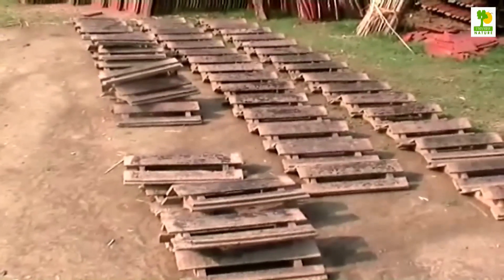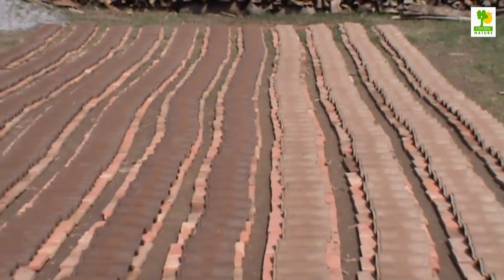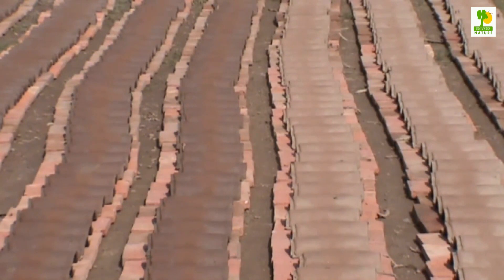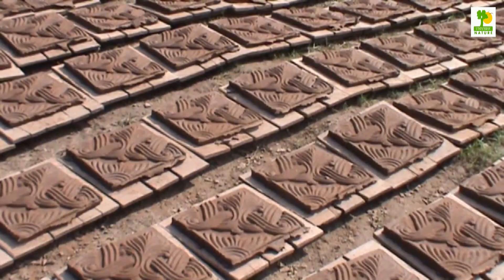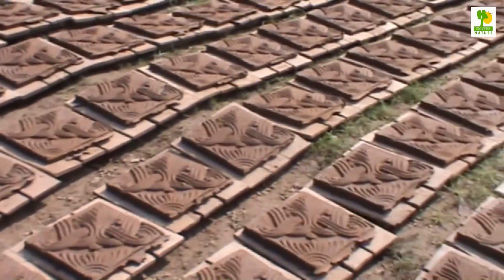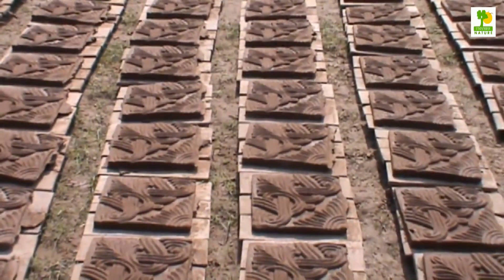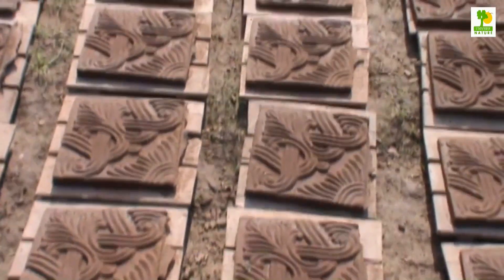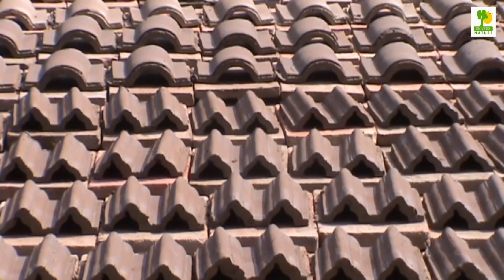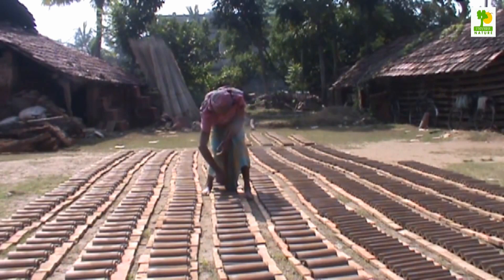Drying racks and pallets are one of the more expensive elements in a tile factory, so careful planning is called for. The racks are typically built up to fourteen feet high to conserve factory space, usually against outside walls for easy access and exposure to drying breezes. To stack tiles, boards are put across the aisle resting on the stringers of the racks. Since the racks will be holding hundreds of tiles and one or more people handing tiles up, they must be sturdy. Uprights are placed on approximately 1.5 meters center, built from 5 cm x 10 cm lumber. The stringers are notched and nailed into the uprights, made from 3 cm x 6 cm lumber. The aisles are around 1.5 meters wide to allow adequate space for loading and unloading of the racks.